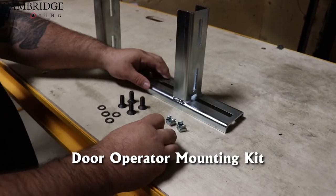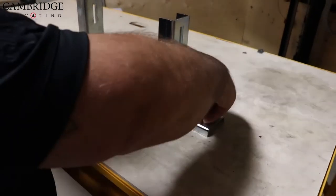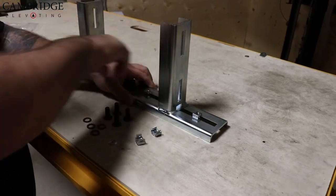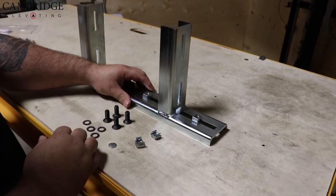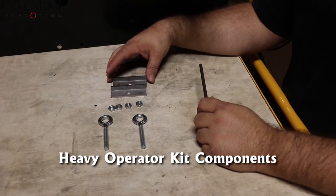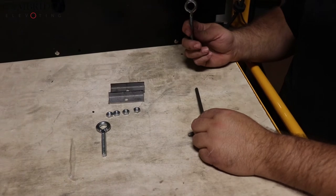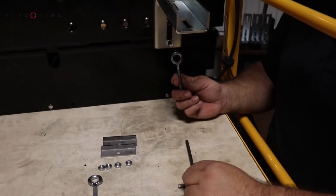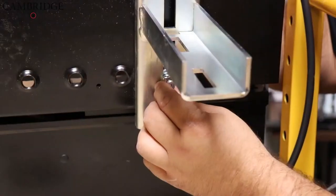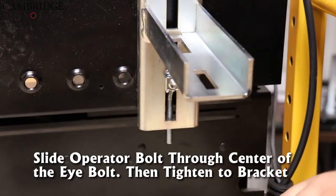Open up the door operator mounting kit — we're going to install our cage nuts onto our T brackets, just like so. Now we're ready to install the brackets on the operator. This here is your heavy operator kit that we supply with the L brackets and T brackets. We're going to install this now over your top nut mounting here so that you will lock it in once it's the other way around. It will hold all the weight for you. Then it's just hand tight so we can adjust it later.